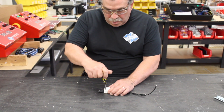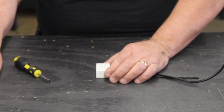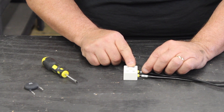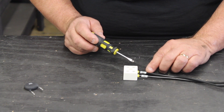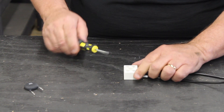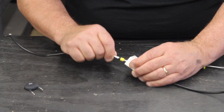You're going to remove the inrush current limiter. I'm doing this on a bench rather than on the transformer so you can see better what I'm doing. If you don't have a spare inrush current limiter, you're going to have to jump the wires to stay working. We're going to take whatever wire is on the bottom — on this one it's 15A — remove that wire and move it to the opposite side from where the other wire is.